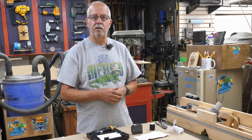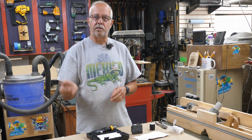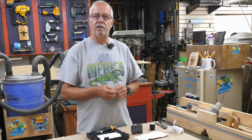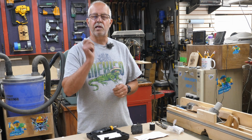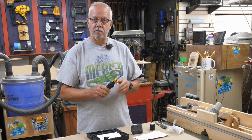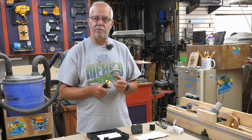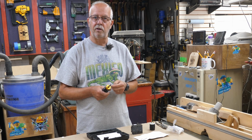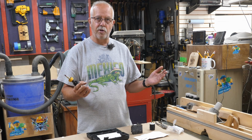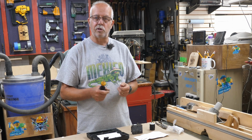Somebody going to check? Maybe. Maybe not. That's what they call the authority having jurisdiction. That would be your electrical inspector. He may take a switch out of the wall, take his torque screwdriver, and check that torque. Yes, it happens, and it depends on the inspector, depends on the engineer. If you're on a big job where you have a lot of precision equipment, electrical equipment, those torque specifications need to be followed.